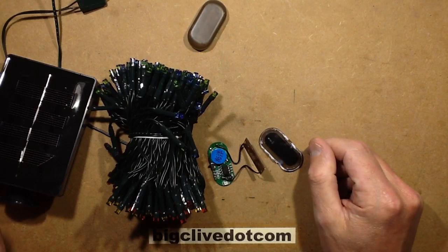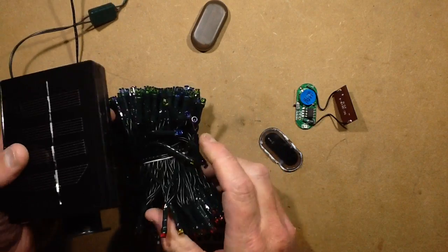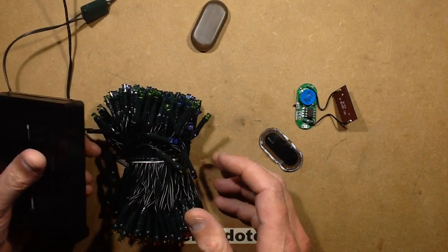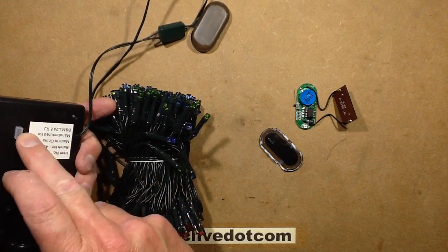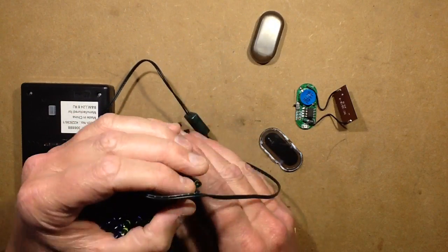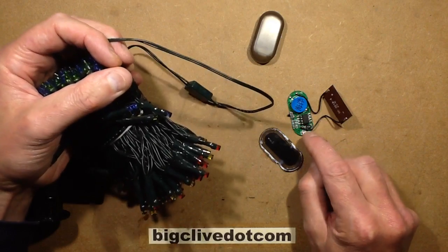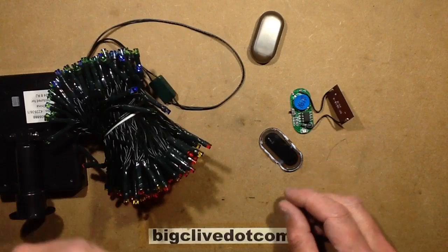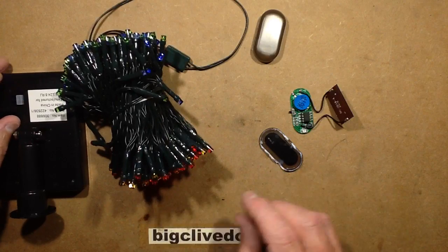In hindsight I should have thought that. It's a standard chip found in solar garden lights. It's designed to charge with the four sections of solar cells giving it about 2 volts, charging a typical 1.2 volt cell. Then it's got an on/off or flash mode, and when you put it to flash mode the LEDs blink rather predictably. You can actually set the speed they flash at. All they've done is adjusted the resistor values on the chip to flash just one single LED with a suitable little inductor, instead of trying to light a lot of LEDs.